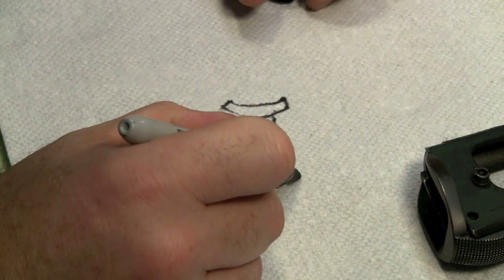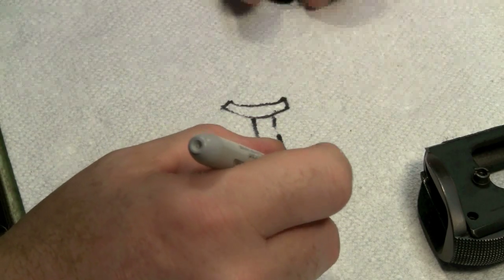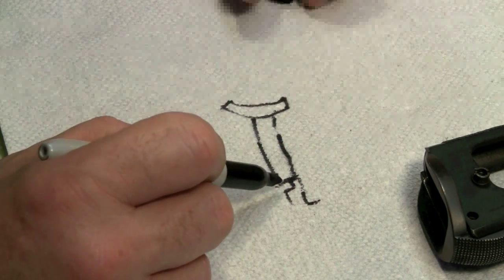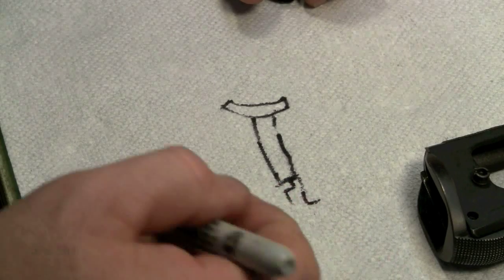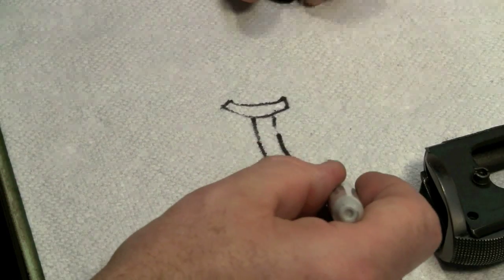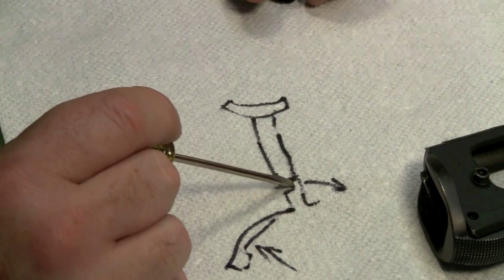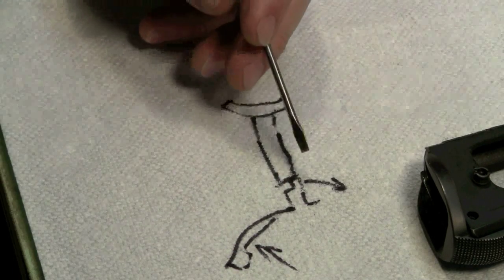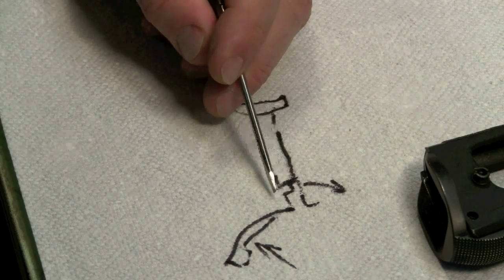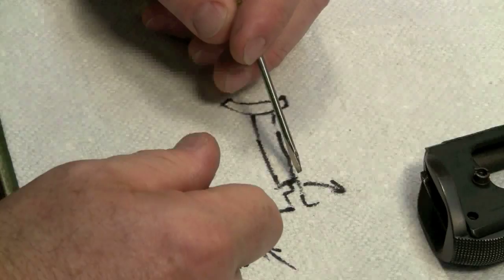And your grip safety is going to look like this, a bit of an over dramatic representation, but something like this, right? When you depress it, you press it in, right? There's your grip safety speed bump. When you depress it in, it moves up. So what you want to do is just grind or just polish the bottom here so that you're decreasing this distance, this width from here to here. So when you depress it, it can leave earlier, so you don't have to push it in as far.